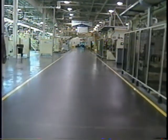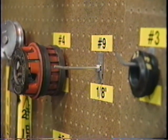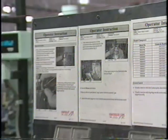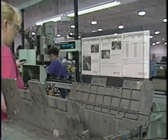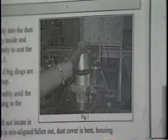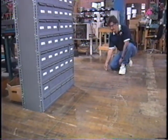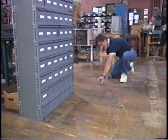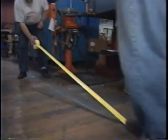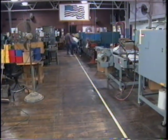There are a few points to keep in mind when you use lines, labels, and signboards to set things in order. First, always understand your audience. Consider the language they speak. Consider where they are most likely to see or read the visual indicator. Next, remember to keep things simple. If something can't be understood easily, it's not likely to be adhered to. And finally, be sure to use temporary materials to test your technique before you make it permanent. For example, colored tape is a good way of trying out lines before you paint them. You will make your technique permanent during the fourth S, standardize.